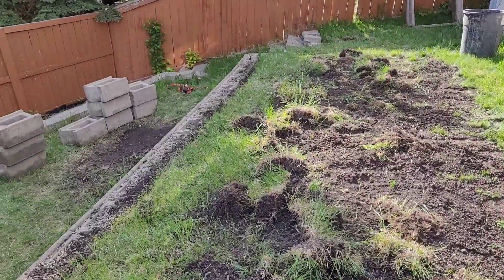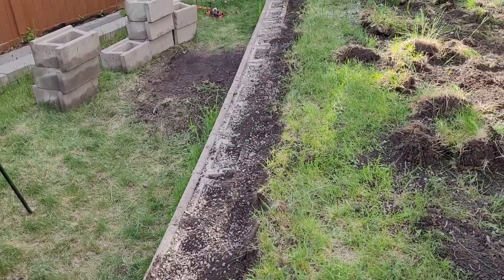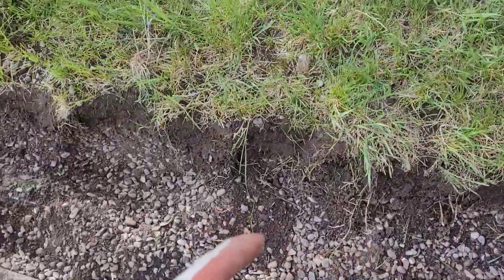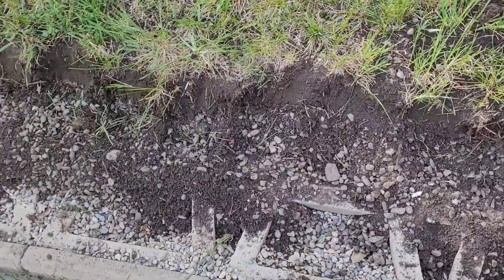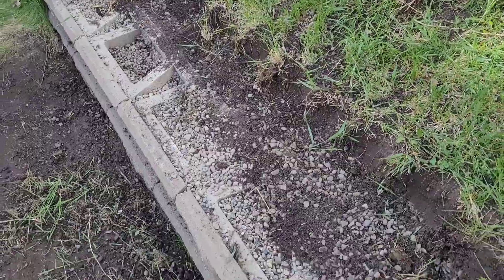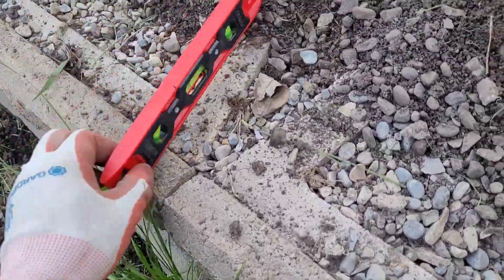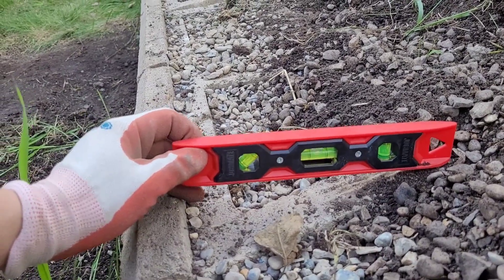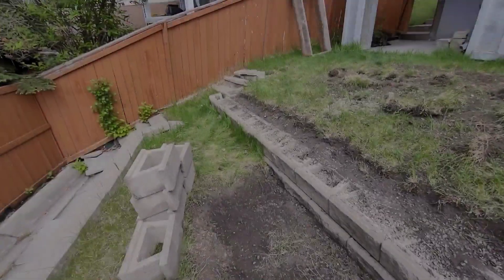Still a lot to do. Another day passed and I only worked maybe a couple hours a day, so it wasn't moving very fast. I removed the first layer of the retaining wall and started digging back six inches. I found a lot of small gravel behind the retaining wall — the builder did consider drainage — but unfortunately the soil dissolved and washed down with the rain, mixing with the gravel so it no longer performs a drainage function. That's where the failure is. With my torpedo level you can see it's about one inch up on the left, showing how much the wall has tilted. I need to dig all the way to the very bottom to fix the foundation.